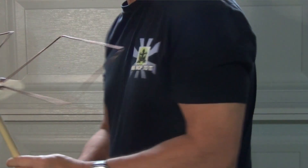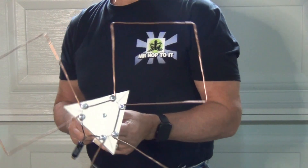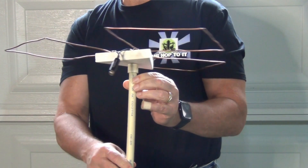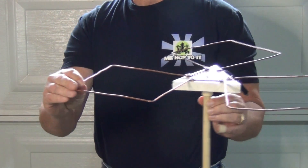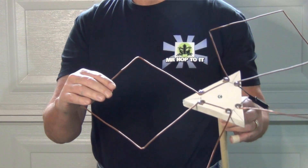The three-diamond antenna had the shortest range of the group, but it still might be the perfect antenna for your needs. If you are in a more urban location and have multiple stations all around you, this is a great choice. The optimum range for this antenna is within 20 miles. Very inexpensive and easy to make, the low profile and small dimensions would work well on an apartment balcony or tucked in a corner of your living room.